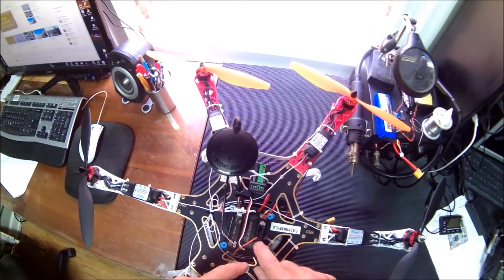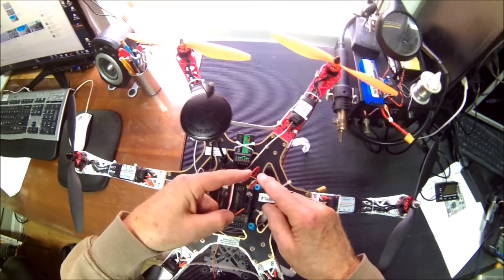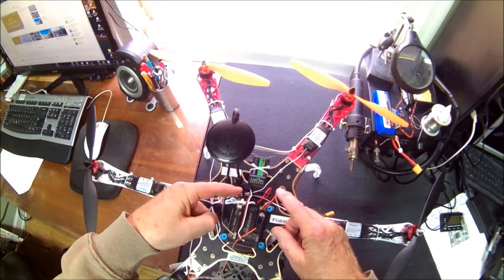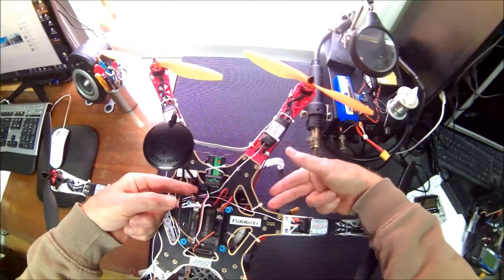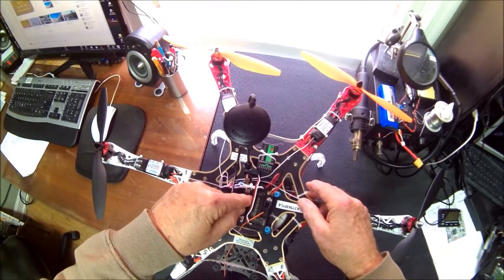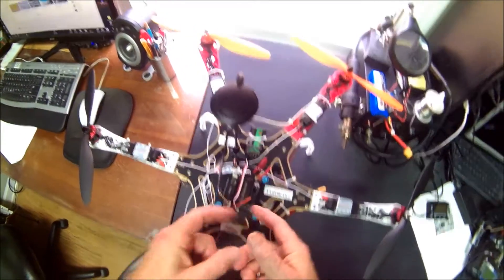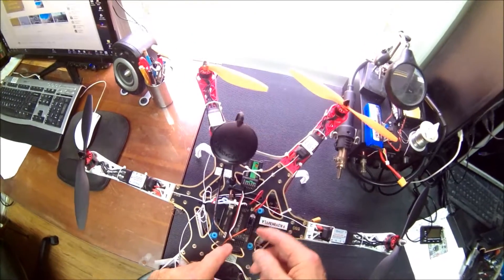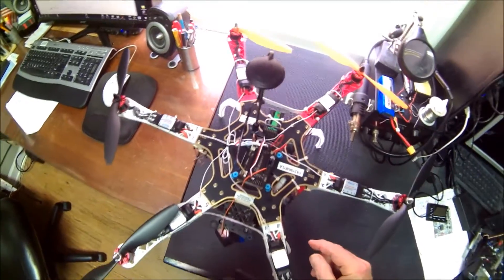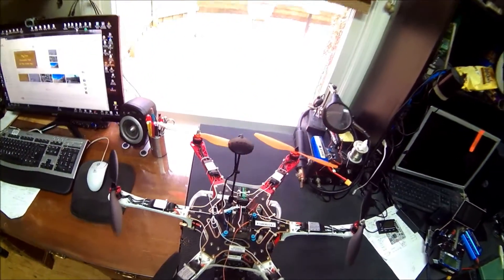This capacitor buffers the 5-volt rail. This jumper gets around the protection circuit — it jumpers the input from the power module coming around from here to here. It powers it, but the protection circuit was dropping the voltage too much; the main rail was low, only getting 4.7 volts. After jumping it, it's up to 5.3 volts, and the cap filters it.